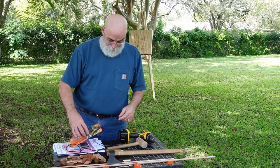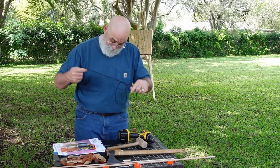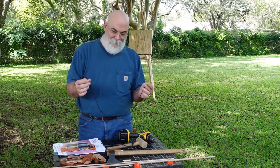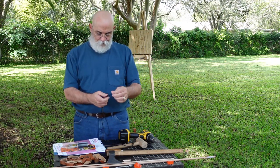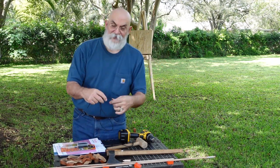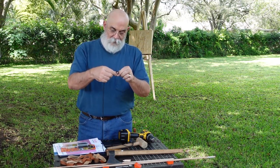So it's probably time to start gluing that axe handle together. But before I do, I'm going to show you how to prepare this cord to make a clamp out of it. On both ends of the cord, we're going to tie a knot called a bowline. To make a bowline, we're going to make a little loop.